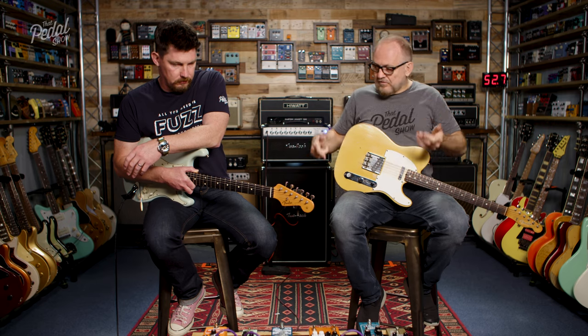So loading and capacitance is a part of the sound. Classic example, Brian May. You think of that coily cable, the inductance of that coil is making a difference to his sound. And you think he's using that guitar and treble boosters into AC30s. You think of his sound, and certainly there's top end there, but man, it's epic. It's not shrill and harsh in any way. And that is part of the sound.